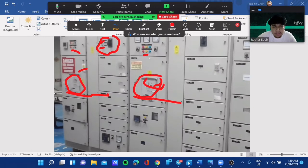It cannot be both turned off or both turned on for the bus bar coupling to happen, because we need one with source and one without source, where the other panel will help supply the source. For example, there are two transformer sources feeding MSB1. We take MSB1 to be turned off. Then the coupling supply comes from MSB2, which is turned on, to support the MSB1 panel.